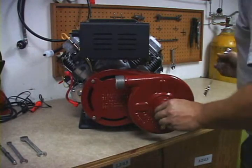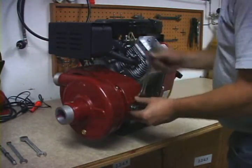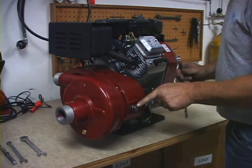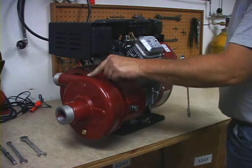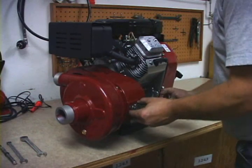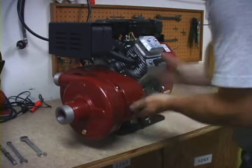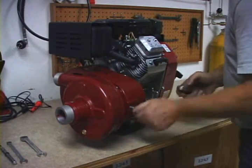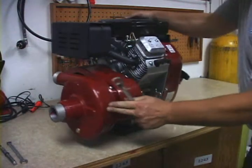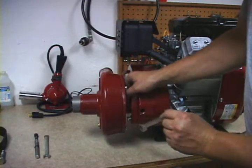The first thing you have to do is remove the pump from the motor. The easiest thing to do is to back off the nut. This nut is used on the shaft of the bolt to pull the pump — it adjusts the tension in and out, or tighter or looser. Then remove the bolt. We have 4 bolts located here; these are 9/16ths bolts. Remove all 4 bolts.